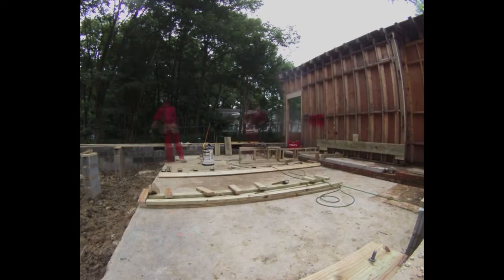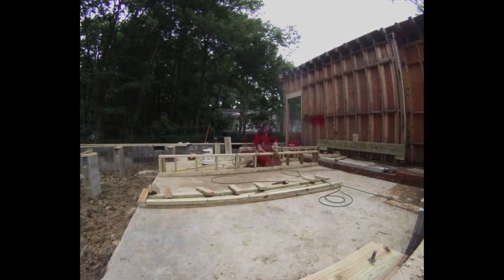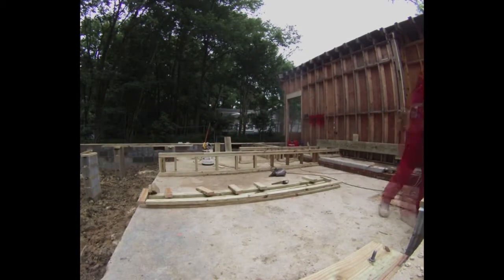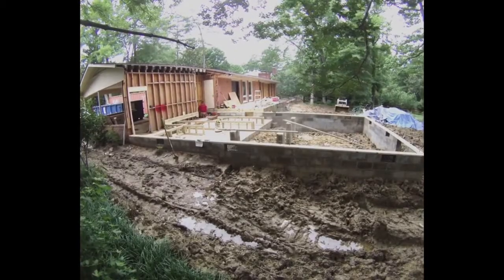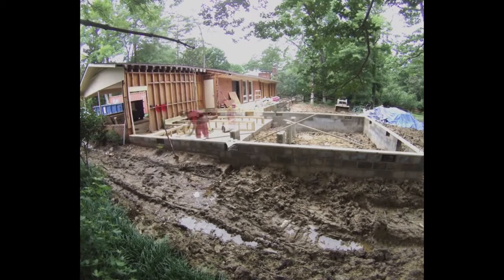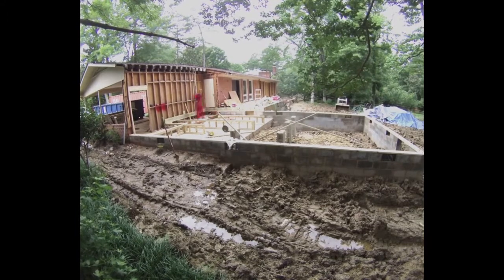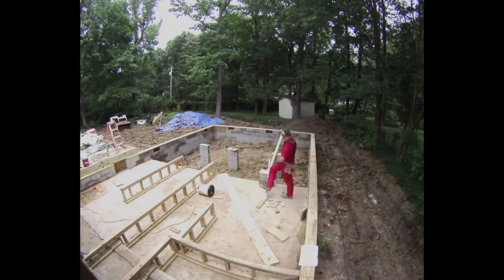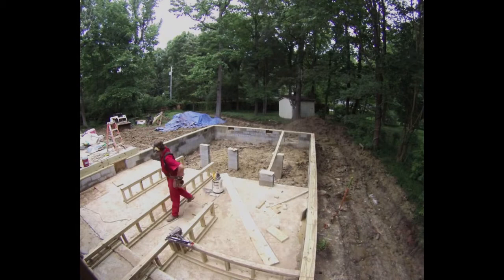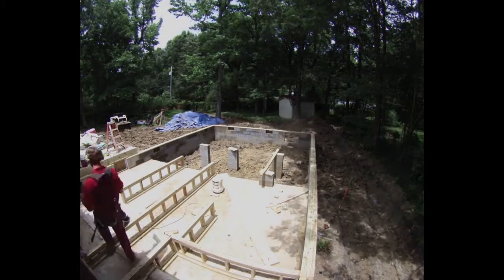I think the addition is about 24 by 33, and I just had to build part of it over top of an existing slab that I drilled through to make sure it was pretty good and thick — it was about four to six inches on a compacted gravel base. It looked good, no cracks. That thing was pretty old, so I had to build these little knee walls and then that's what I placed the joist on top of — that's what the engineer spec'd out.